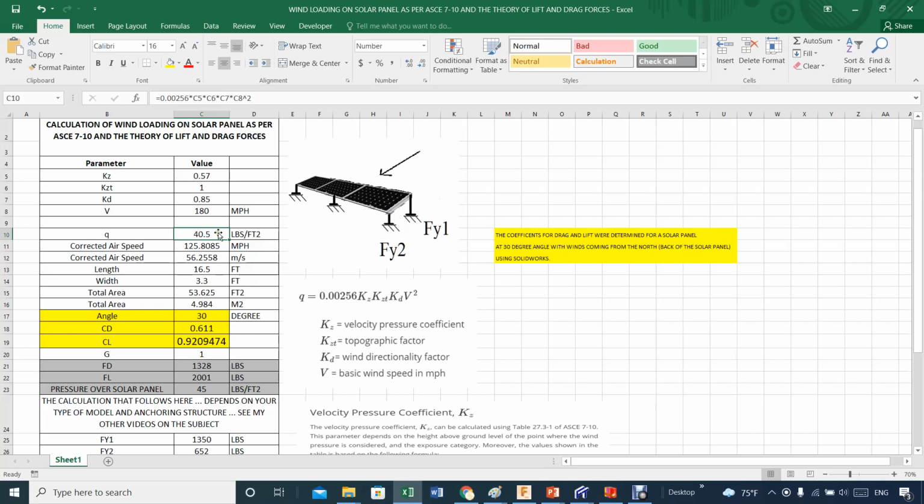When you do that, then here is when I switch to CFD, Computational Fluid Dynamics, and I obtain the actual airspeed for my solar panel. When I got that number, I punch it in any CFD simulator like SolidWorks or the simulator from NASA. It's not a solar panel, it's a plate. It's a plate at a given angle, like emulating a wing, an airplane wing. So when you get that, eventually you get the coefficient of drag, the coefficient of lift, and based on the total solar panel area, you get these two numbers, the force of drag and the lift force. This is in pounds.